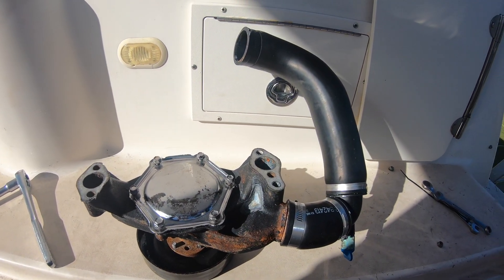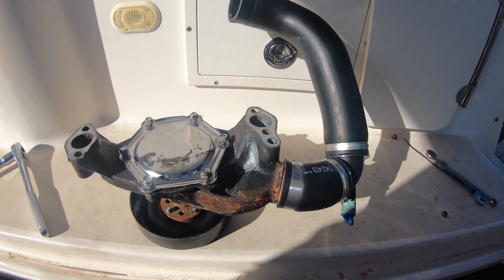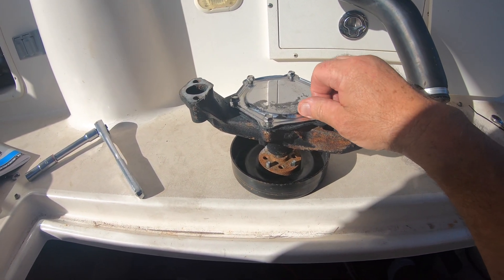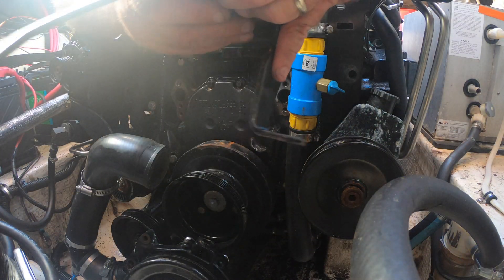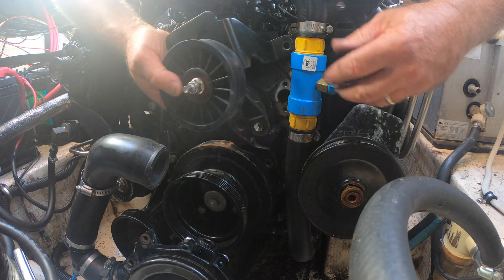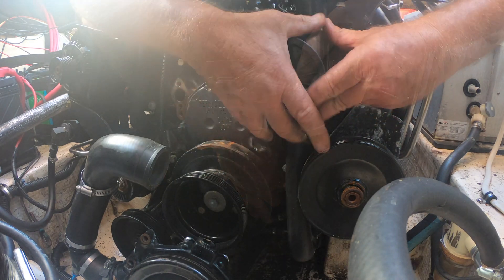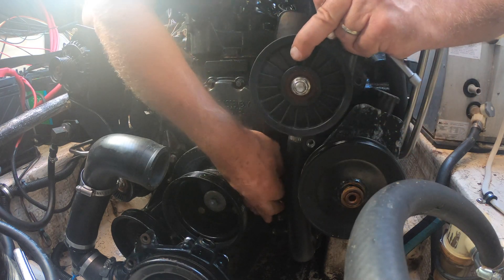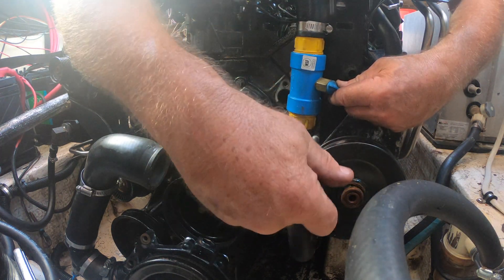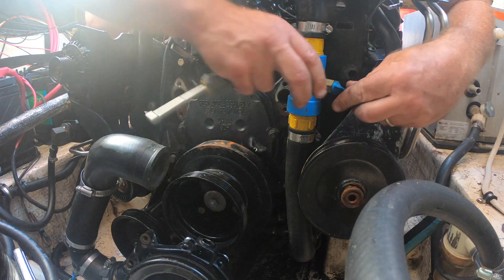Now it's time to put the seawater block recirculation pump back on. I dumped it in some phosphoric acid to clean everything out and got some of the rust and salt corrosion out. Next it was time to put the tensioning pulley and the bracket back on — it was a little bit of a puzzle, but I got it back into place without removing anything else. The bracket seemed to bind just a little bit with that low-point fitting drain, so I loosened the hose clamps and moved it a few degrees over. All of the low-point drain and flush areas on the Mercruiser 350 MPI are color coded in blue.